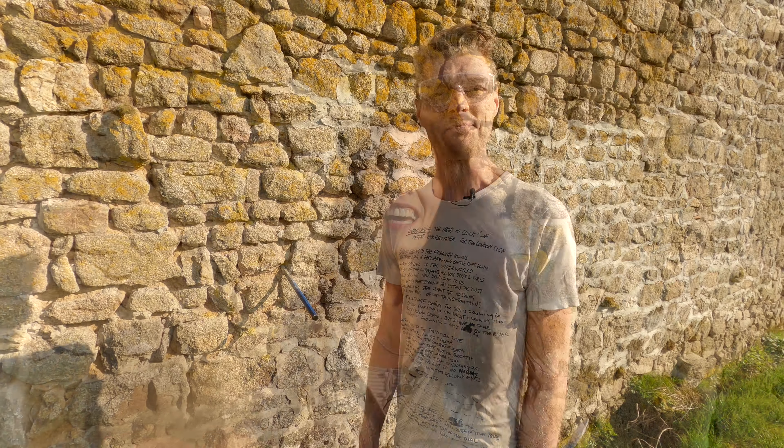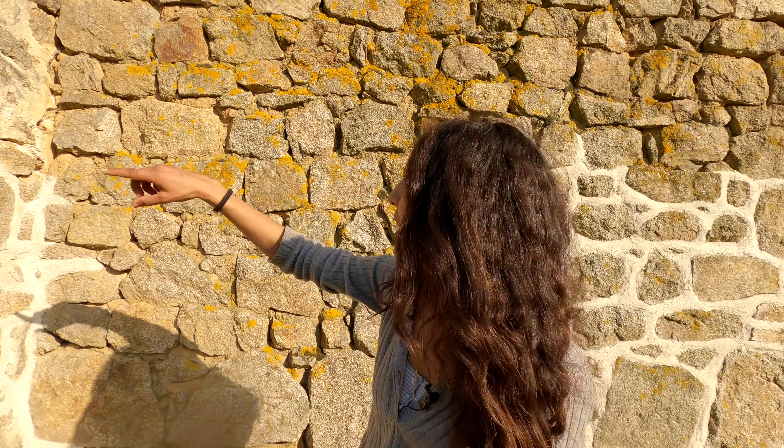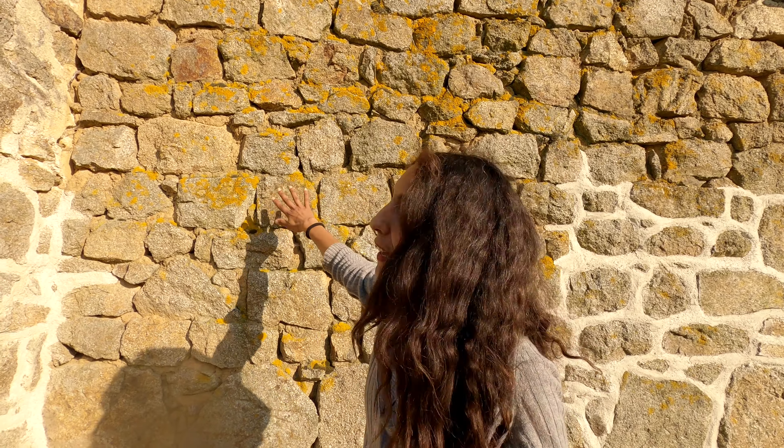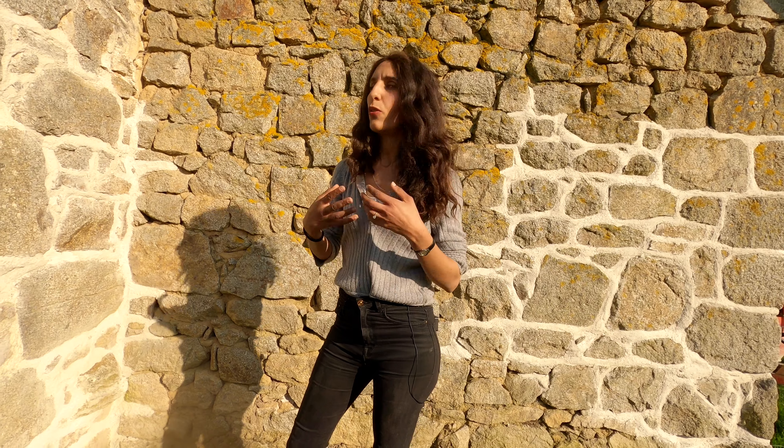Hello everyone. My name is Meriem, and I'm going to show you and explain to you what a mortar does. It spreads the load throughout our wall and prevents our wall from cracking. That means that when we point the walls, it stops the stones from touching each other. The benefits of lime: it's breathable. So we know that our walls are going to breathe. Lime is an antifungus, so we're never going to get mold or damp inside our wall because it's going to dry.